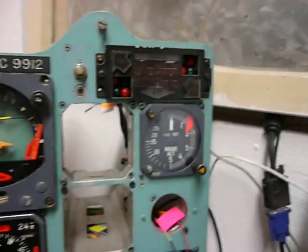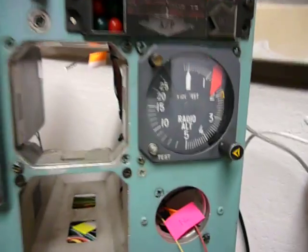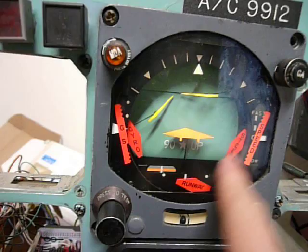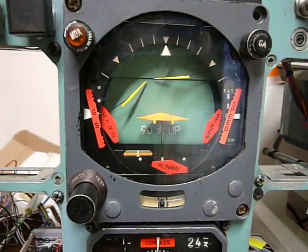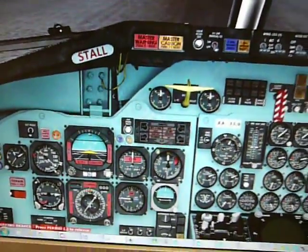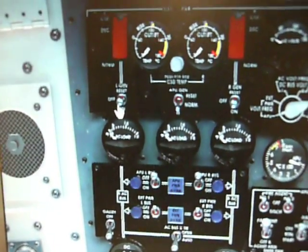A few things are working, some not, but this is the first bundle as I said — first time today I'm showing you something that is mounted into the panel. The radio altimeter is completely working, the annunciator is working, the autopilot trim indicator is working, all the flags, the speed command indicator is working, the glide slope is working, and the roll is working on the horizon. I will work on the pitch next, but I'll check if the same is happening on the simulator. The engines are started to make it quick, so the only thing I need to do is connect the power from the engine generators which are currently turned off.